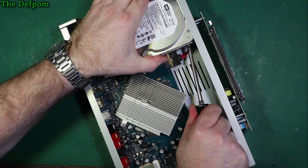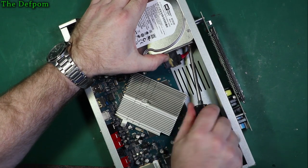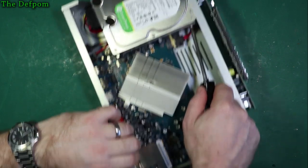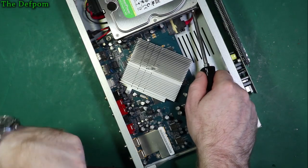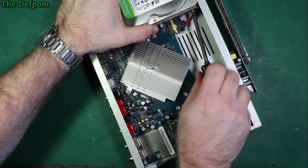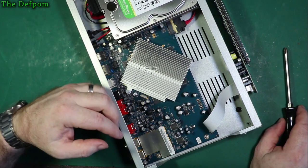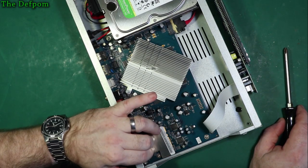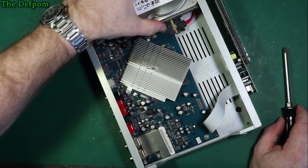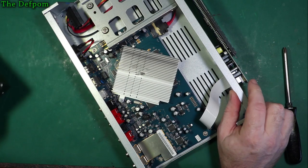So, anyway, right now the situation we're in is that it's got some kind of problem, I don't know what it is. Also the feed through from the RF, which is down here, is working okay, it's not a glitch with the signal level. If it was affecting the TV on the live view, it would be within the RF section, but I don't think it is. I think it's in the digital section somewhere. So I'm thinking it's a power supply problem of some kind.